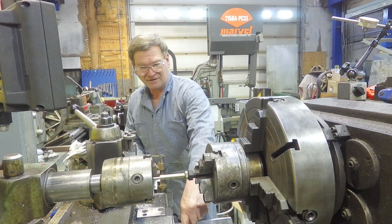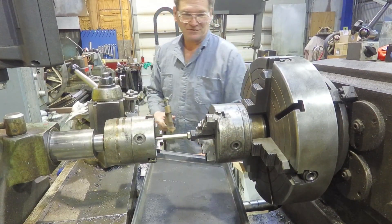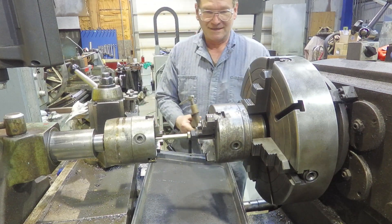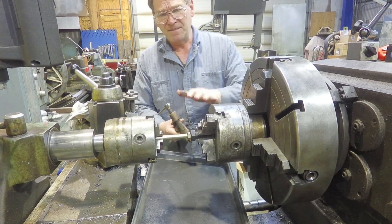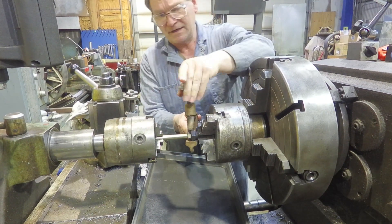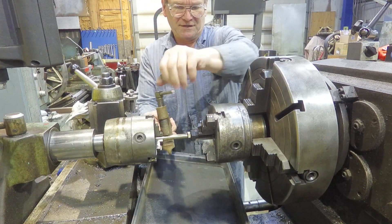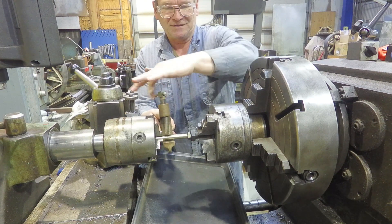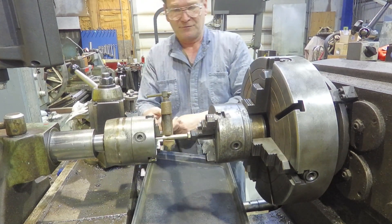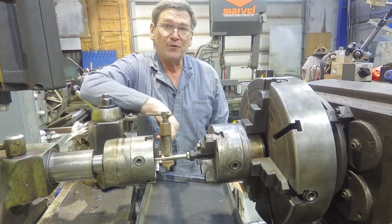If you're going to weld on your lathe, first off don't weld right on the lathe — you need to cover up your ways so that any sparks that get down there are taken care of. The best practice, though it can be a headache, is if you can put the ground close to the work. If we were welding these two bolts together, we'd pick a point with more room and weld right in between them — but that doesn't fix the whole potential for problems.